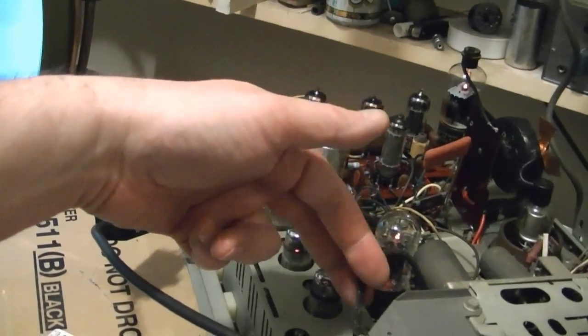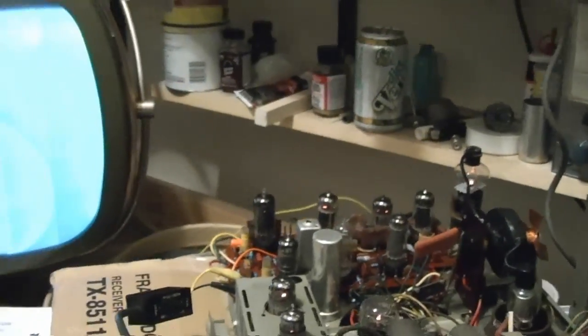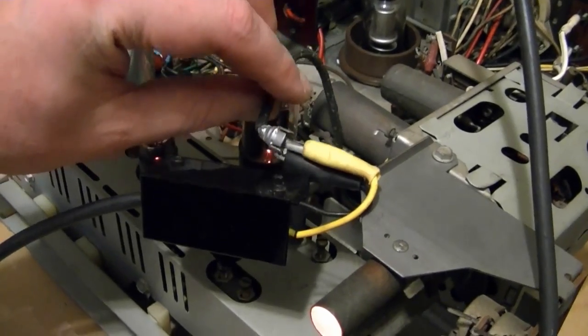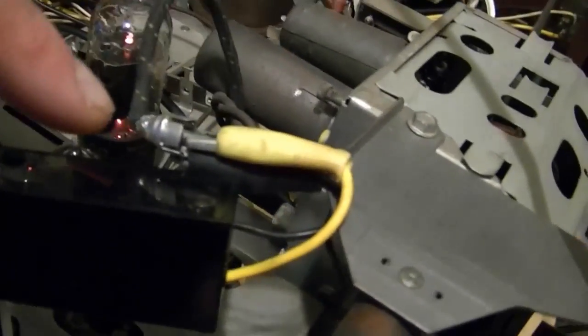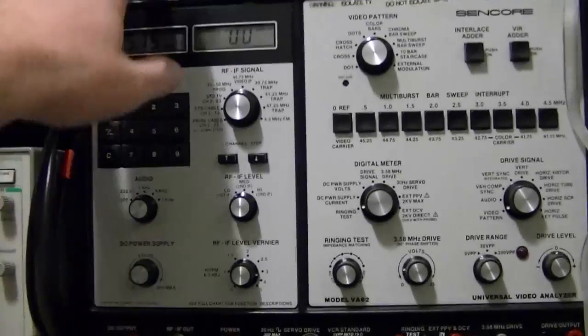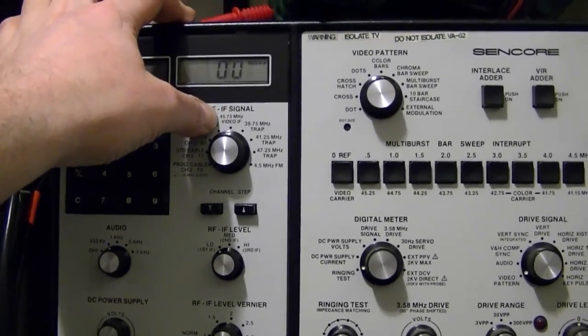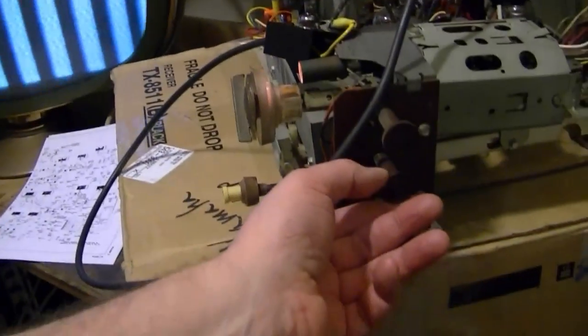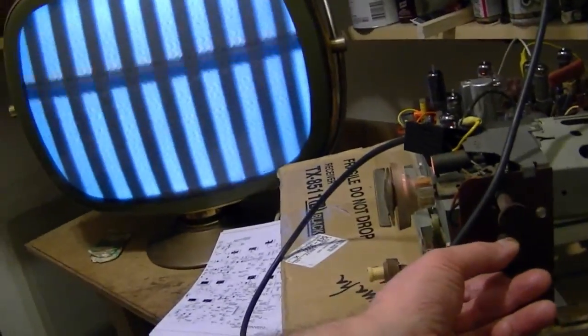Moving a step back, now I'm injecting a signal into the front end of the IF — it's an RCA connector, but I managed to clip on the two leads from the output pod. This time I'm using the VA-62 in video IF mode, which does put out various test patterns modulated to the IF frequency. And, hey — what do you know? It is stable. If I rotate the hold control, it definitely locks.